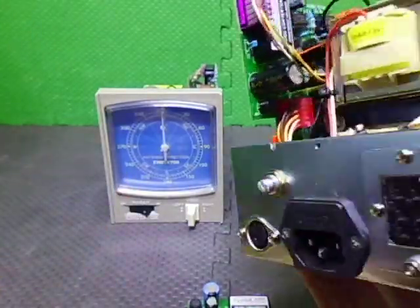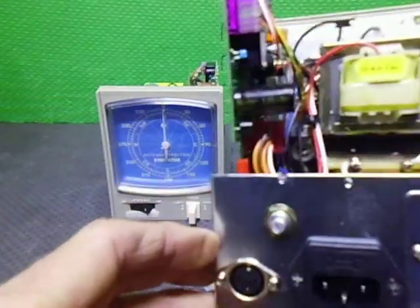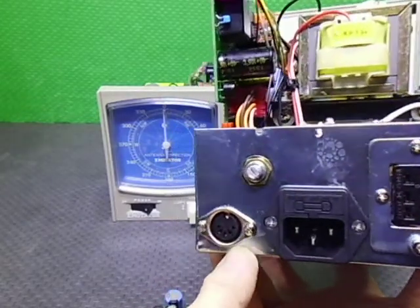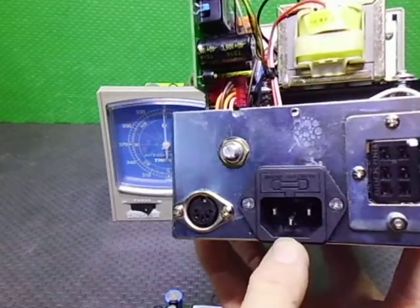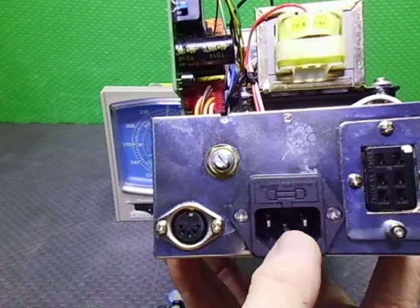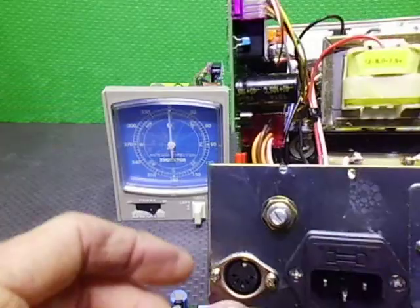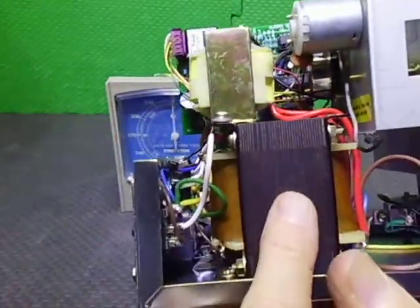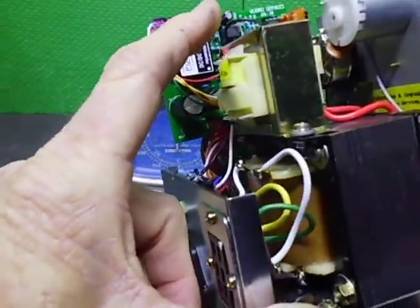In this video I'm showing what I've done to these. I've given it remote control output — hence the RS-232, the DIN plug coming out. I've also put an IEC cinch socket on the back and changed the plug. And we've got a new cinch plug here. Basically, I've added a transformer because the original didn't have one to drive the new remote PCB.